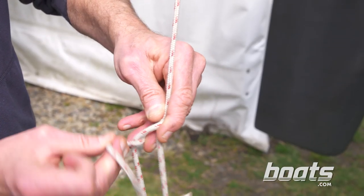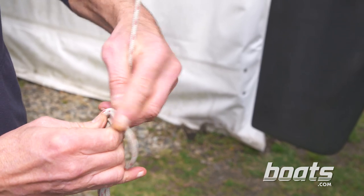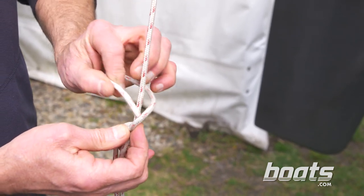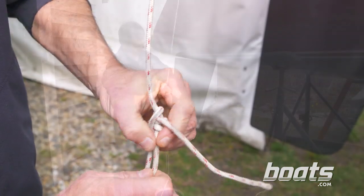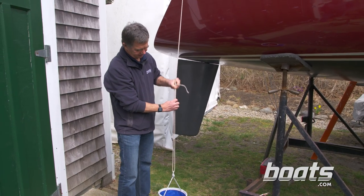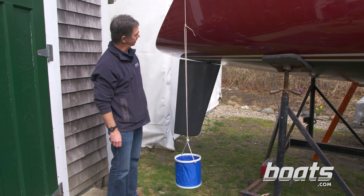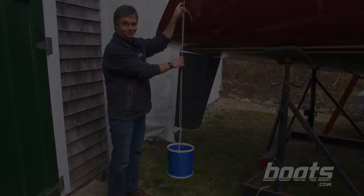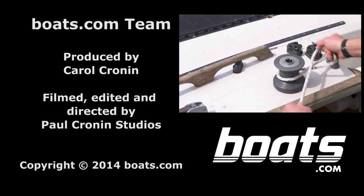When you're tying around a piece of line, you make your two round turns. Try to cross over that first turn with the second on the inside. Then cross over the outside and make your last hitch. Pull that up tight, and again it's going to resist lateral pull really well. You're going to be able to adjust things like that. Have a lot of fun with it. Two half hitches thrown on in the same direction.